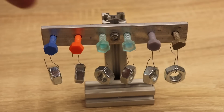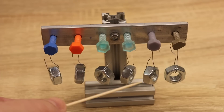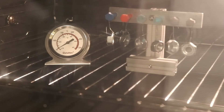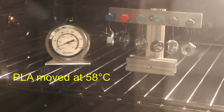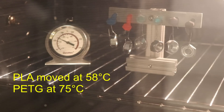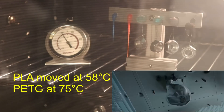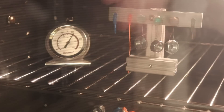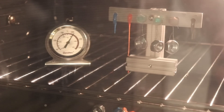This is my setup for the temperature test. In order: PLA, PETG, Siraya Blue, water washable resin, and a different PLA Plus — just curious to see when they fail. They stand out exactly 15 mm and I placed a small load of M10 nuts on them. I placed all test specimens in the oven and recorded the temperature at which they first moved. Both PLA samples moved at approximately 58 degrees Celsius, PETG at 75 degrees Celsius. As for the resin, it's more than 200 degrees inside the oven but I will stop the experiment here.